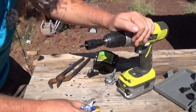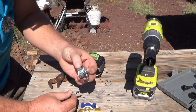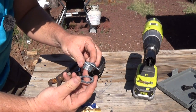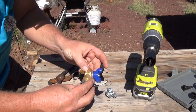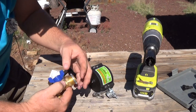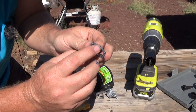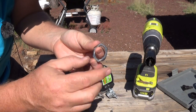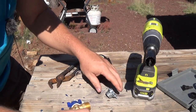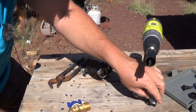I got thinking that when I go to drill this in it might come loose, so I have a small nut that goes with an electrical conduit wire clamp, which just happens to be the same threads as this spigot. When I go to put that on, I can put that nut on the opposite side and it'll help hold it. There are little grooves in there that help bite it into whatever you tighten it onto, so the goal is to have it bite onto the plastic and not come loose.